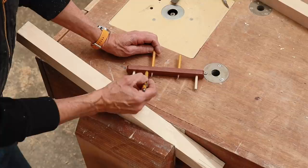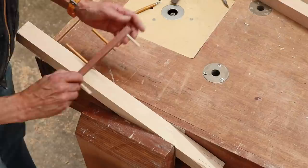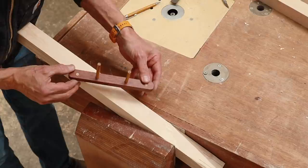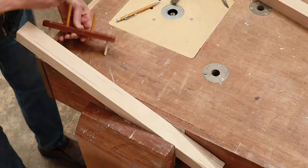I've put together a spar maker's gauge here. I've made it smaller, but it still retains the ratio of 7 to 10 to 7. Mine is 1 and 3/4 to here, then 2 and a half, and 1 and 3/4 — so it retains that same 7, 10, 7 ratio. The way this works is that when it's on the spar, these two pins ride along it. So if the spar gets wider, those pencils move across and it retains the same proportion. You simply put it on and draw, and you end up with that same 7, 10, 7.